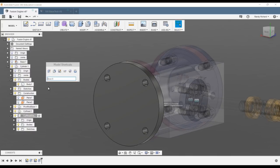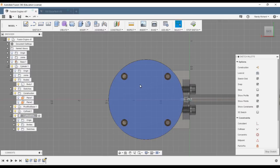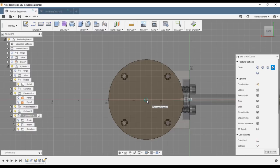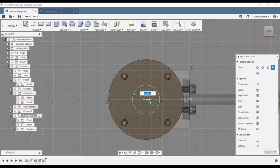Another sketch on the surface, press C for circle in the center — this is 0.500. This is the creation of the boss. There's also a through hole in the center, so we're going to put that through hole in now. That's a number 11 drill — a number 11 drill is 0.191.